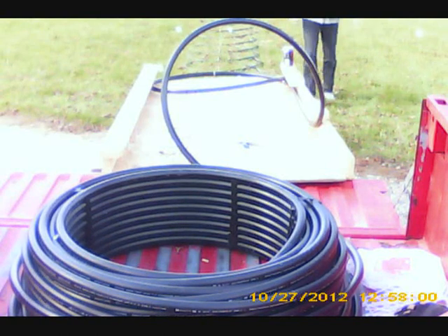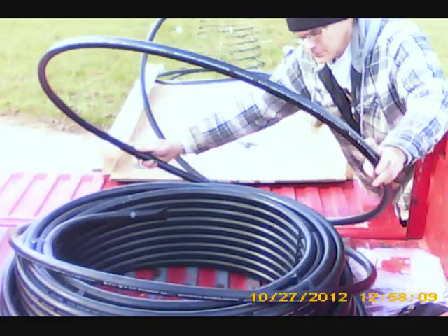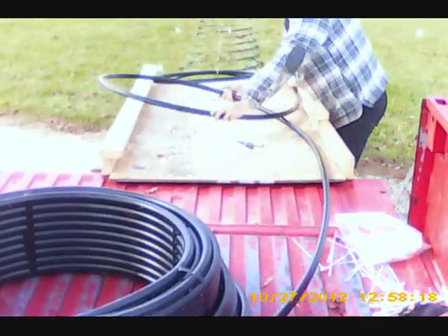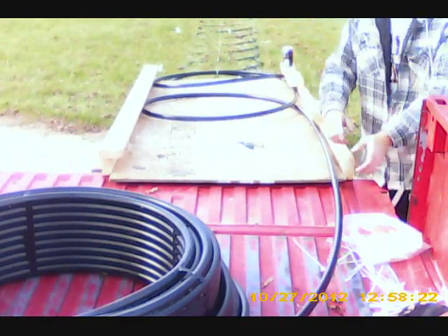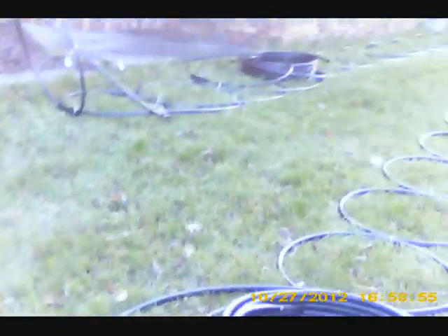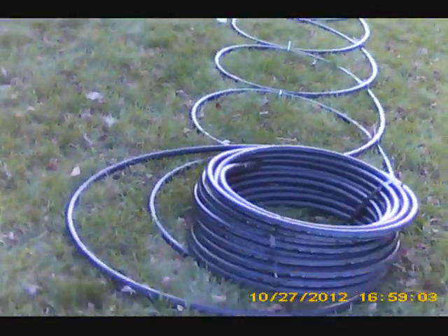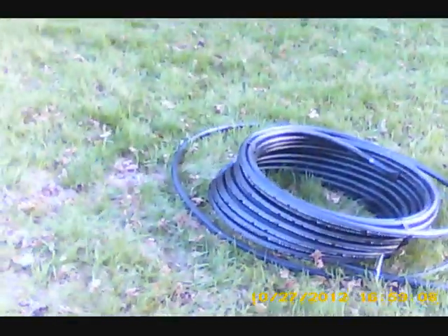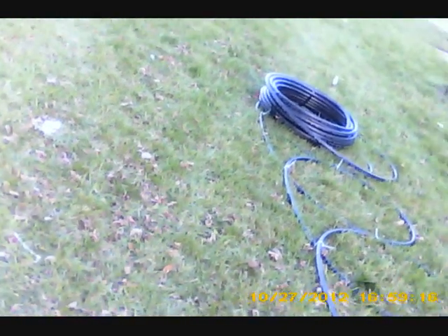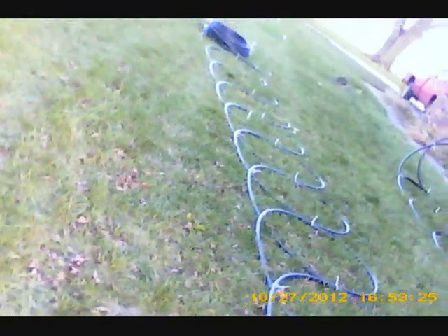So you overlap the slinkies by as much as you have room for. If you've got room for just trenching in straight pipe out and back 300 feet each direction, then that's fantastic too. But I've got the room for it — I just didn't want to do that much digging. So I decided that 100-foot trenches were a good way to go, and I'd get a lot better performance than if I did 66-foot trenches. I've also left 100-plus feet of ground loop here at the end of the slinky unattached. This will be the far end, farthest from the heat pump. I haven't attached it to the side of the slinky like everybody else does, because if you do that you'd just be mixing your hot and your cold together, and that just seems silly. So I'm going to bury the slinky 8 feet deep, then put 2 feet of dirt in, and that remainder of the loop is going to be the outgoing pipe — giving me a free 100 feet of heat exchange off of that pipe before it even enters the return loop.